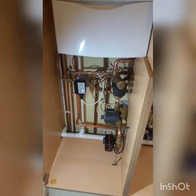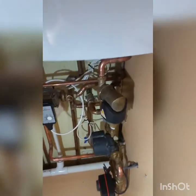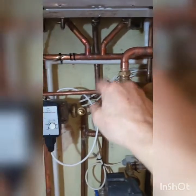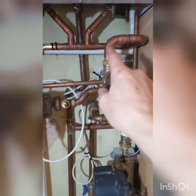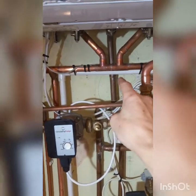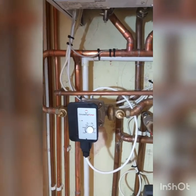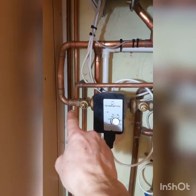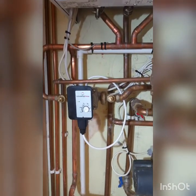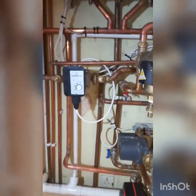The job is complete with a few minor adjustments still to make. Let me run through what we've done. We've used close-coupled T's here. There's a pump, a filter on the return coming back, and I've tried to give as much of a linear run on the inlet to the close-coupled T's as possible, and the same on the outlet. It's just impossible to follow all the rules - you're constrained by space, so you work out which compromise matters most.